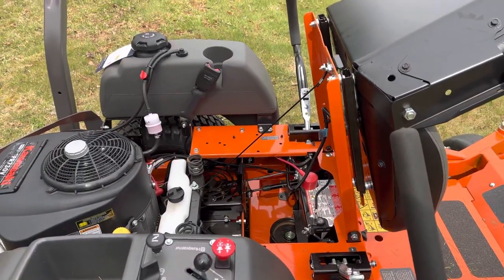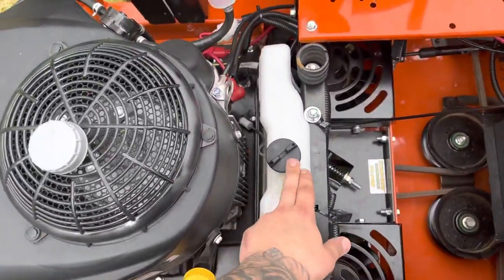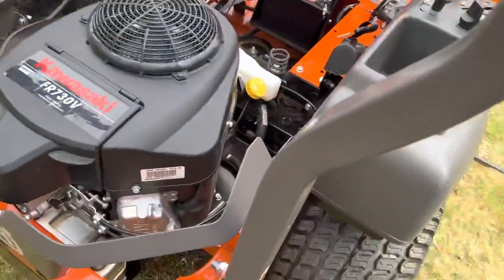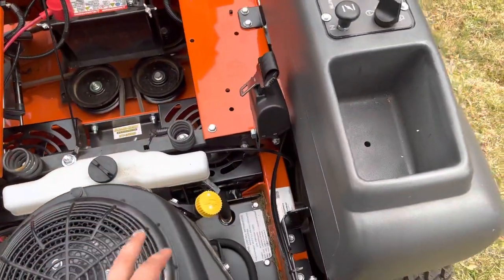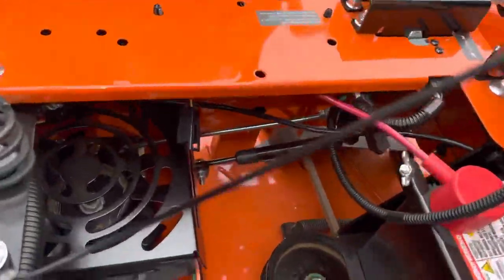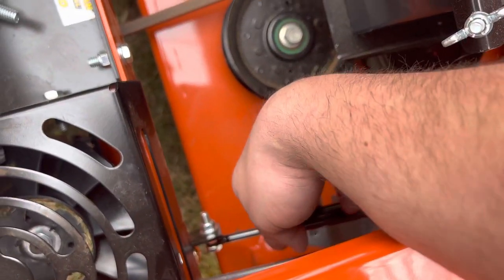That was one of the first things I did when I got home. I had it put on the trailer, and while it was still in the trailer I started checking the hydraulic transmission and the engine oil. The hydraulic transmission fluid, which is a 20w50 grade oil, was low. The engine oil was low — right on the add line. I also noticed the steering piston on one side was pushed out and had about half an inch of play, while the other side was tighter.